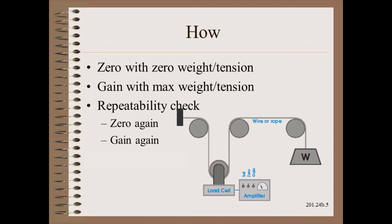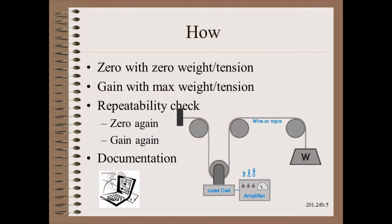The work is never done until the paperwork is done. Maintenance should record all readings and results so that they can be checked against previous and future readings. This documentation is essential to establish the trustworthiness of the tension system in general and drift of the load cells in particular. With practice and planning, this entire procedure start to finish — including documentation — should take far less than one hour, and the machine downtime less than 10 minutes with experience and planning.